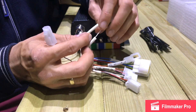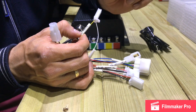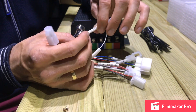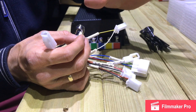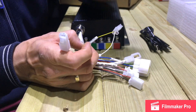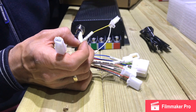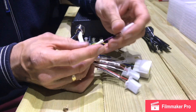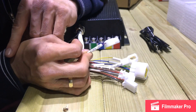The brake zero volts is a safety feature to be used with e-brakes. If you've got an e-brake lever it will have a sensor inside, and you can wire that sensor together with the negative. When you press the brake, the sensor will short it with the brake wire and it will just shut down the controller. This is a safety feature in case you have a fault with your throttle and it is stuck in an open position, which would be very dangerous.